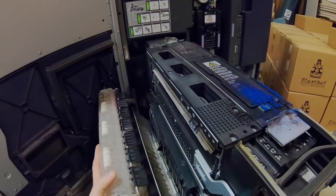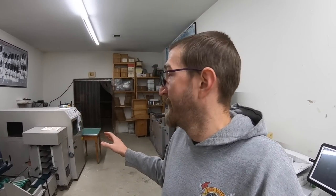It was a madhouse in here over the past couple months because we were doing so many more books than I ever do, and this place was filthy. I had two hydraulic failures on the trimmer — one was just an O-ring, an easy fix. It's great to keep an O-ring kit on hand so you can just swap it out and keep going. The second failure was the main hydraulic cylinder for the side knives; I took it to the local hydraulics shop, they put new seals in it, and we were good to go.